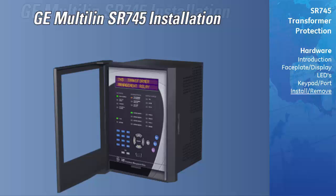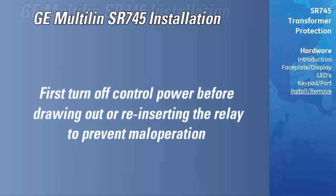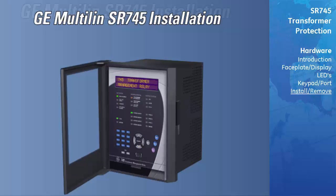To remove the unit from the case, first turn off control power before drawing out or reinserting the unit to avoid maloperation. To remove the unit from the case, open the cover by grasping the center of the right side. Press upward on the latch and then pull the front door, which will rotate about the hinges on the left.